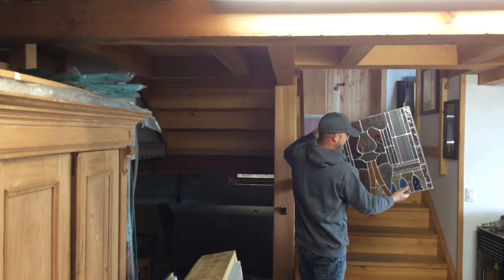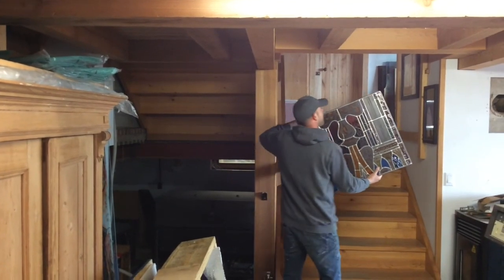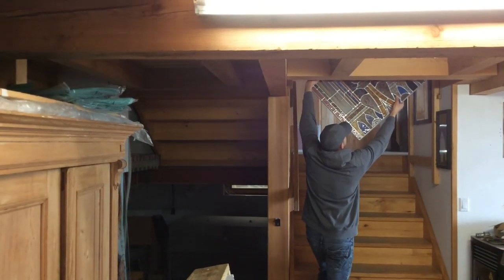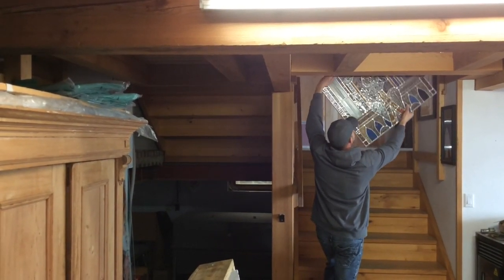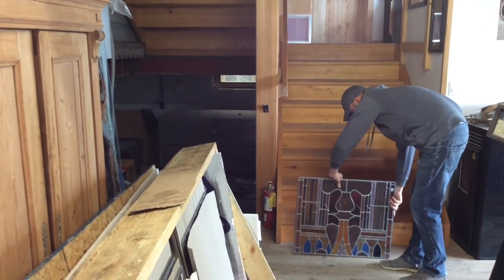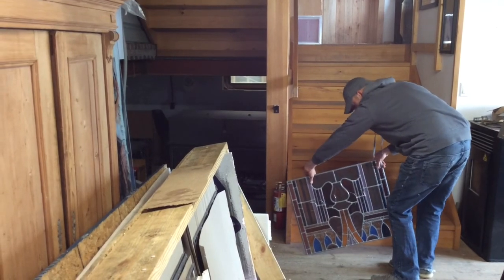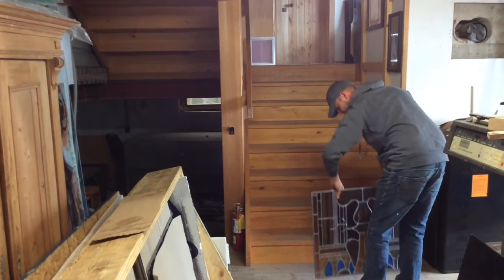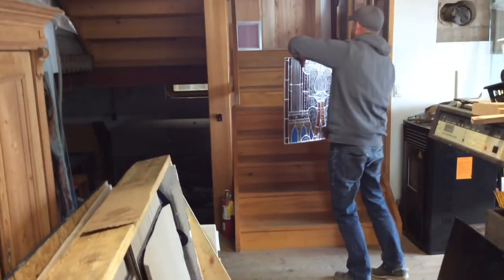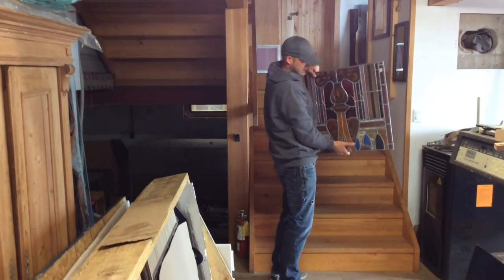You want to have at least half of the panel in your hand like this. Walk up to the platform and pass it up. A person will be above there grabbing it — as it comes up to them, they would be standing on the platform. This corner comes up to them, they grab it here and here, bring it up, rest it on their feet, get a hand underneath, and then pass it up to the next person until it's at the right level where it needs to be.